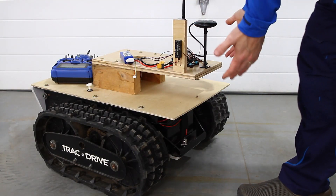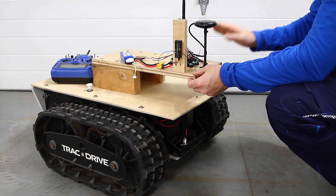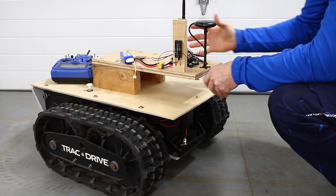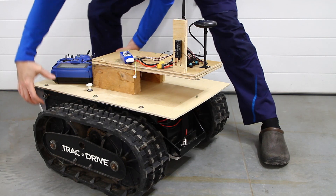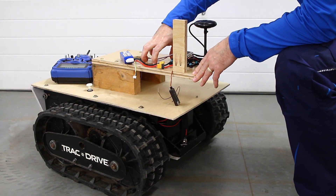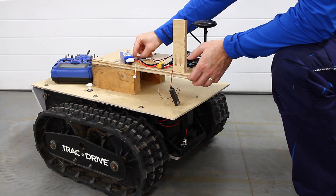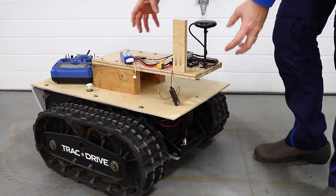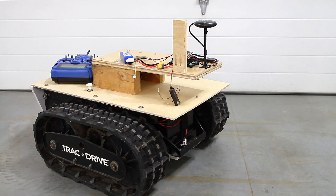In this case I used wood because of the ease of rapid prototyping. This pedestal is up and forward to get the compasses away from the big magnets in the motors that sit back here. The platform is also easily removable — I take these screws out, unplug the Sabertooth right here with easily accessible plugs, and can do all of the calibrations by moving it around. That's why it looks the way it looks.